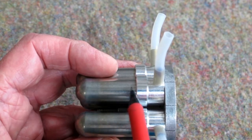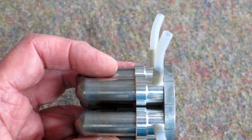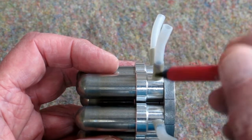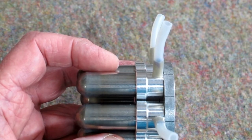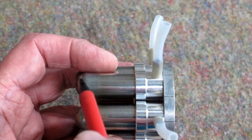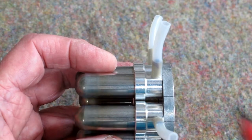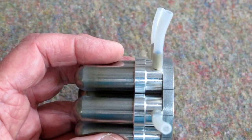The hot air is traveling and pushes on top of the piston. The piston pushes through the connecting rod to the crankshaft and causes the engine to rotate. When the piston gets to the bottom of its travel, it starts upwards, pushing air back in this direction through this tube. The power of the piston is from the momentum of the spinning engine. At that point in time the pressure here is a little bit higher, and the displacer is moving in this direction and helps distribute slightly cooler air back to be reheated. Each cylinder in turn, that process just repeats itself and the engine keeps running.